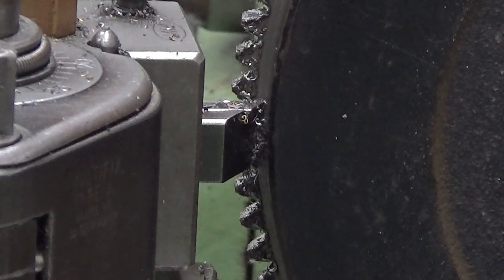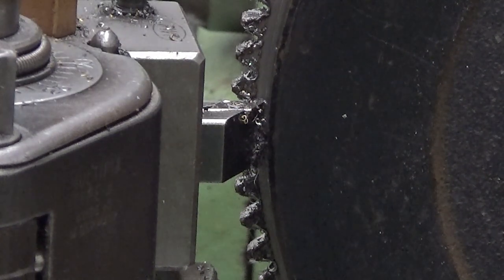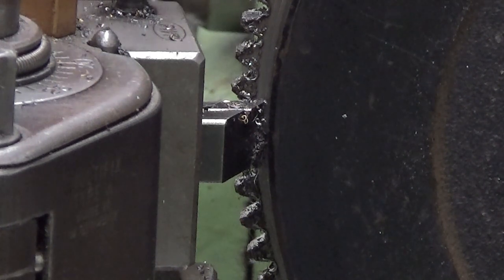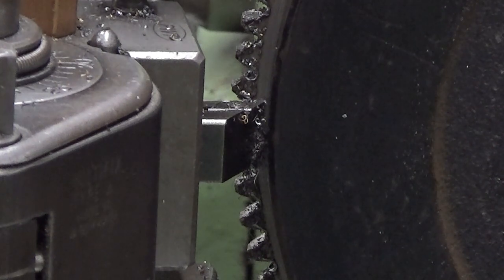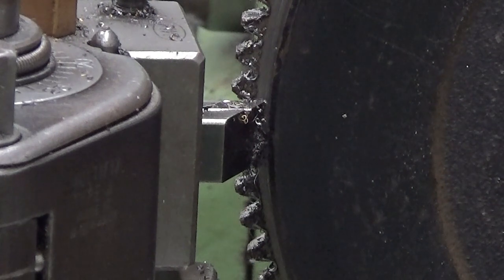And this is now running something like 70-80 revolutions per minute. And the feed is 0.038 millimeters per revolution, so it's very slow feed, very slow speed, and very thin cut. But it won't be a thin cut because the burrs are really, really proud here. So this can destroy the blade. I don't know. Let's see. This will be a little bit exciting. So here we go.